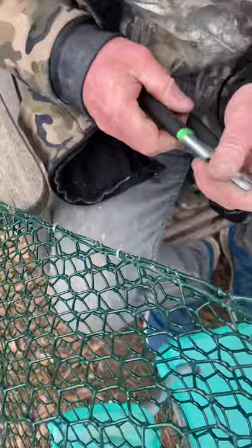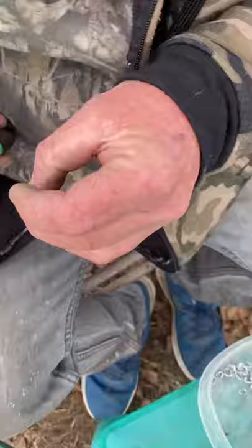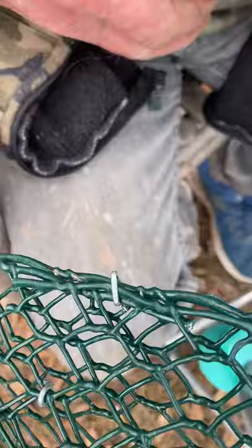We got some big ones in there for the middle. Now we got some little small 1/4 inch or 3/8 inch hog rings, and then we got some hog rings that are 3/4 inch. These are what the bigger ones look like. Michael's getting that together now. And that's gonna go in the middle because you have to hog ring 3 wires together. When you hog ring just 2, you use the smaller ones. And when you're doing the 3, we use the bigger ones because it makes it easier on you.